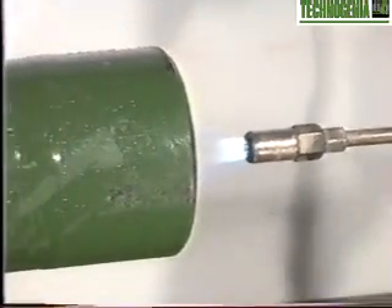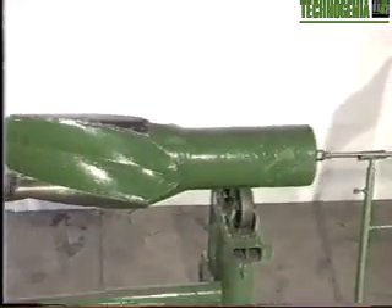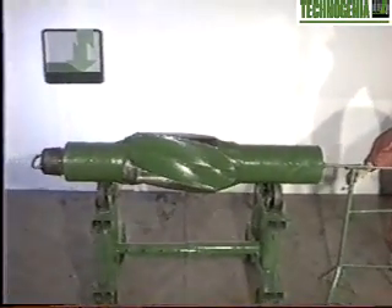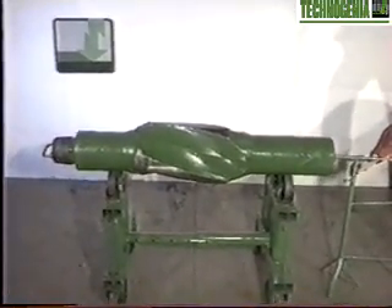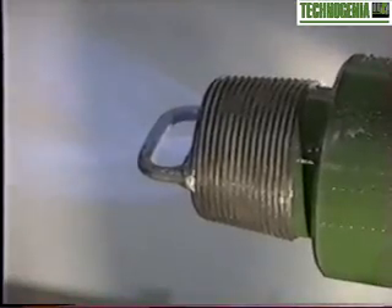The stabilizer must be properly positioned to be worked on easily. First, as usual, grind the blade to remove all rust and dirt. Because of its volume, you must preheat the stabilizer to 300 degrees Fahrenheit using a furnace or torch.